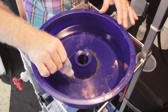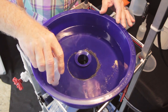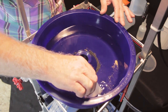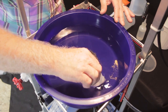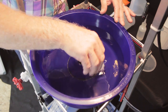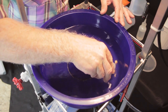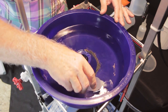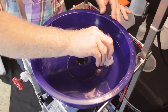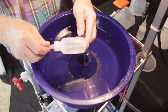A few pieces over here — we're going to blow it all back into a nice little pile. I call this gold herding. Then we're going to snuff it up with our snuffer bottle and get it out of there. Looks like we may have about six or eight grains of gold in that concentrate — this is pretty good stuff. We'll give the bottle a nice hard squeeze and then vacuum. We'll get this gold out of here. If we don't get every single piece of it, we're not going to worry — you'll see why in a moment. Now we've got an awful lot of clean gold already scooped out of there.